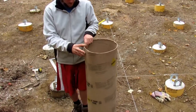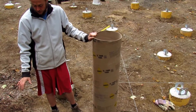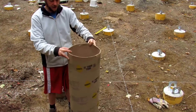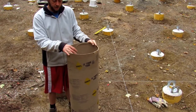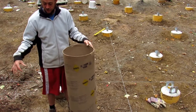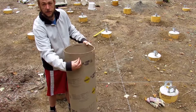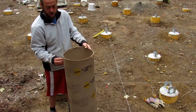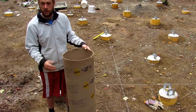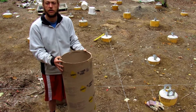What I've been doing is laying a footer base of concrete in the bottom - two to three to four inches depending on what the hole looks like - then slipping your sonotube down into that and filling with concrete. To level it, backfill a little bit with dirt without tamping it down, then place a level on the side, level it out, then tamp the backfill and fill the rest of the way. We'll show you a video of that once we get to it.